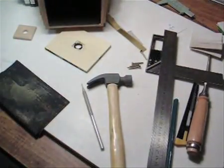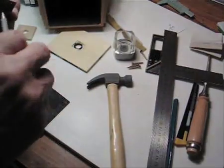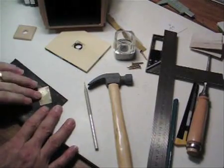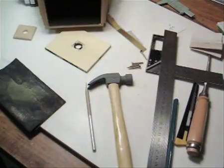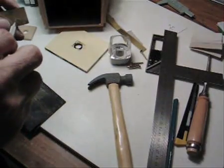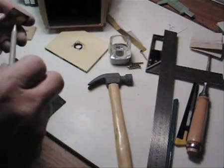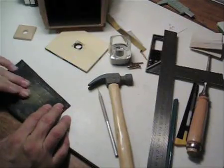Have a look through a magnifying glass, go through the hole a little bit more, and keep working it to get it rounder. Any burrs in that hole won't do your pinhole any good. What we're looking for is to produce the roundest hole we can on this piece of brass.